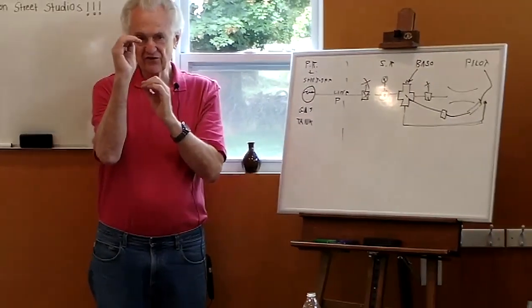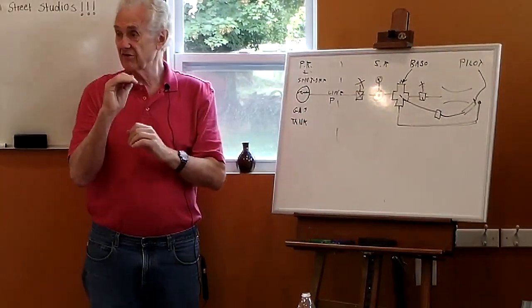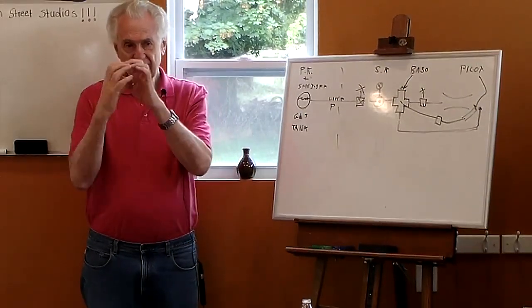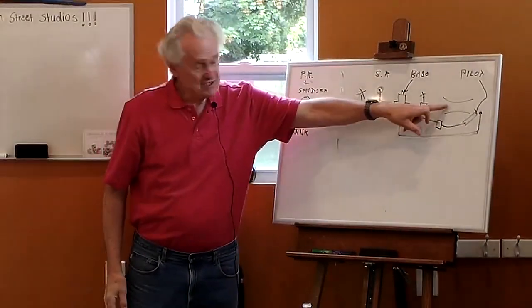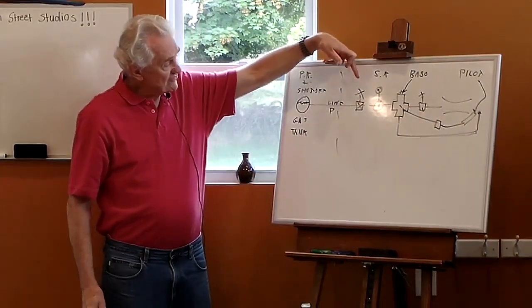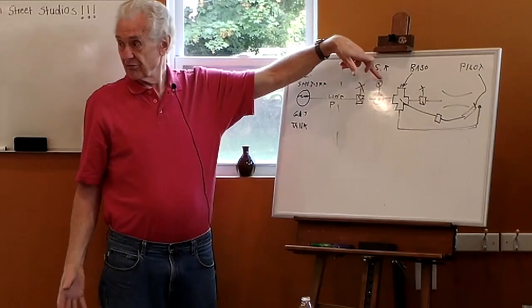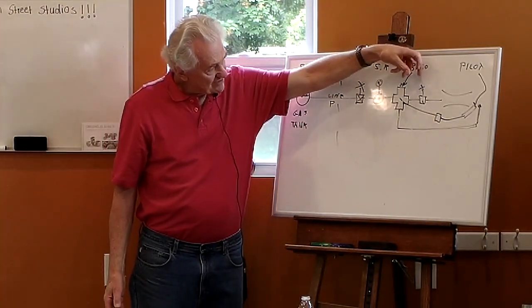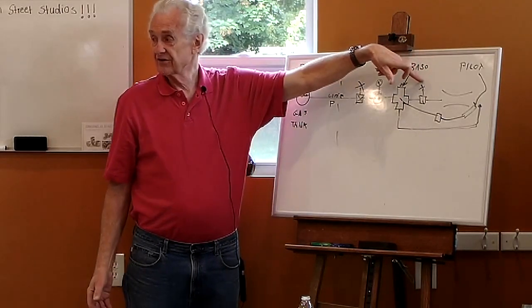And so I end up with this sort of crescent, looks like the phases of the moon. I end up with either a crescent-shaped opening or a full opening. And that's the one that I actually use to control how much gas is getting to the kiln. So when I fire it, I set the secondary regulator to some pressure, and then I open this valve increasing amounts to get the temperature to rise.